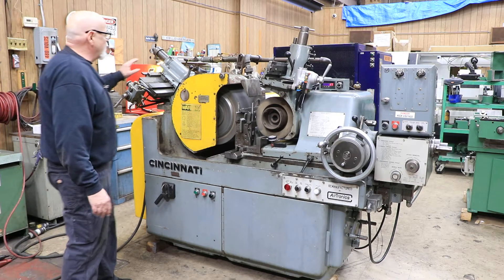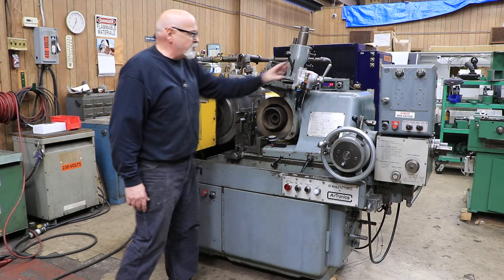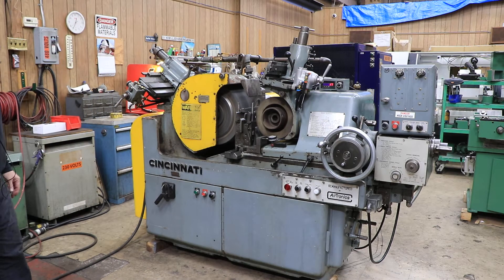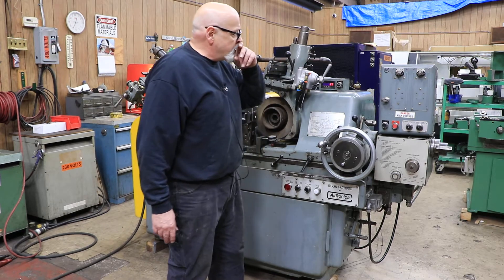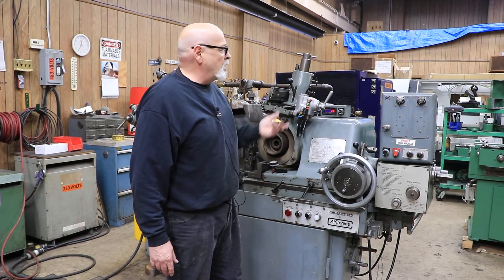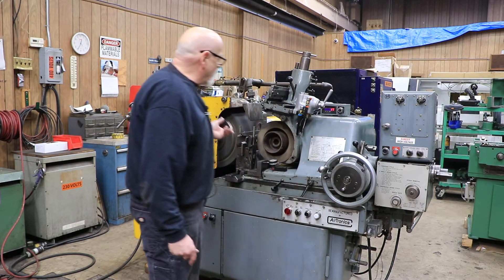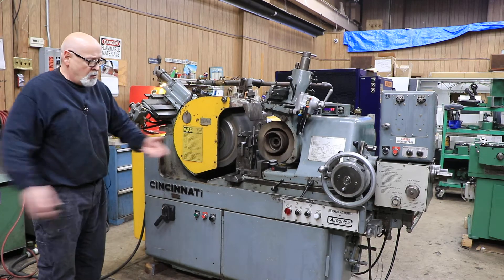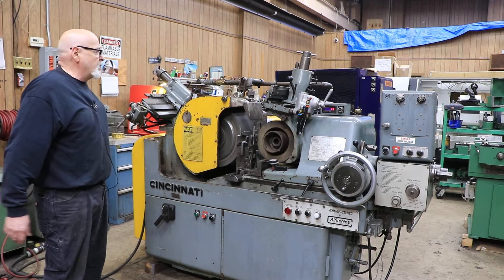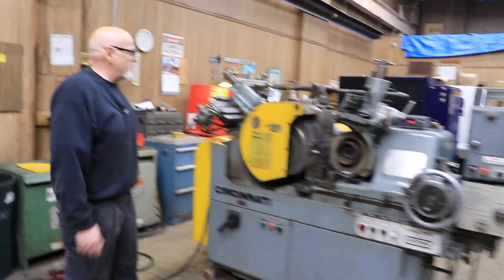We've removed the two dressers and gone through them, cleaned them all up nice. We had to get a new valve — or reconditioned valve — for this dresser here. This is currently wired for 220 volts. It does have an automatic infeed device on it. This can be timed with a loader so that it can load and unload parts with a mechanical loader, or in the case of what we have on here right now, it's actually a through-feed setup where you can run your bar through and depending on the angle of the regulating wheel, it will pull it through at a certain speed.